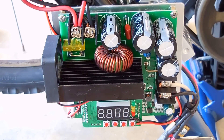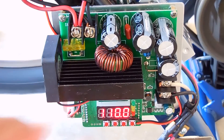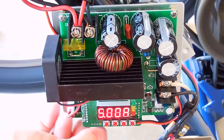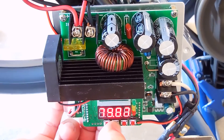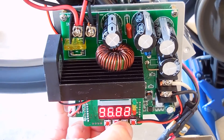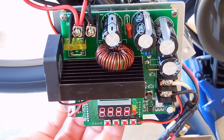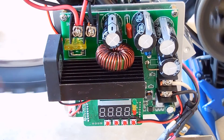Let me rotate the pedal by hand on the low gear to show you how the display works. You can see it's set for 110. I can select and go lower if I want — of course you have to keep it higher than the input voltage, so I wouldn't go lower than 55. If you want to go higher, push the other button. I'll keep it at 110, set the current to 5 amps, and push constant voltage. Now it will give the 110 volt output.